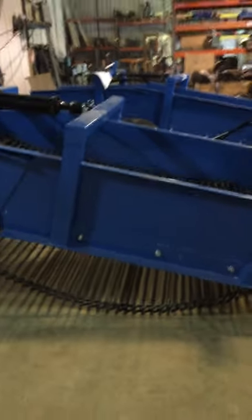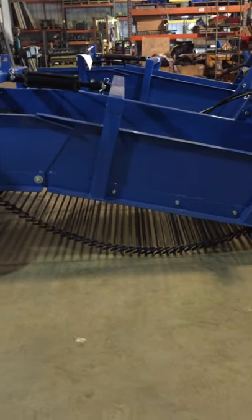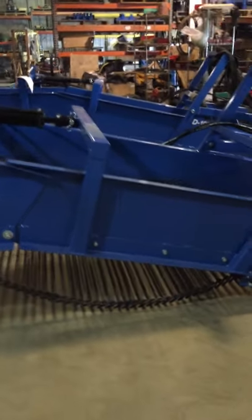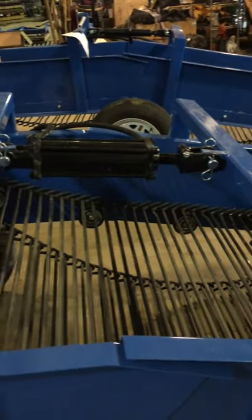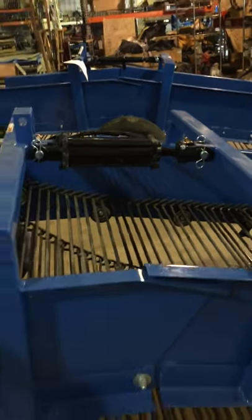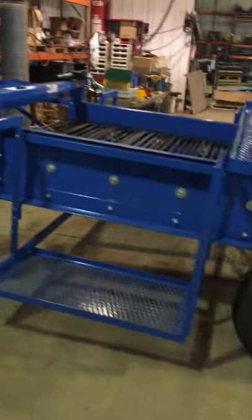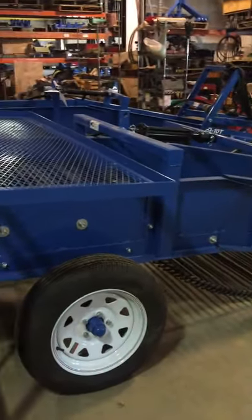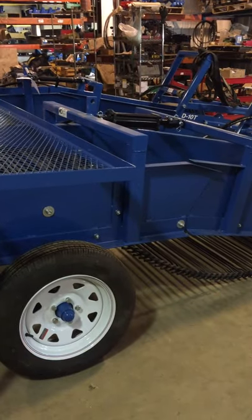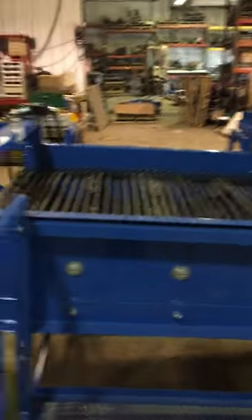This digger might have a little bit of extra chain in it, but the user can always take a few links out if he's dragging too much, and he has some spare links. This is the tail lift cylinder — when you turn this machine around at the end of the field and pick up the blade, the standing platforms can drag in the ground, so there's a cylinder there to lift the tail. If you're not running with racks, you could go behind this machine and just run a straight table up high in the back and dump into some other container.